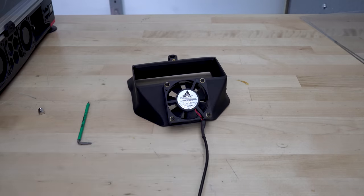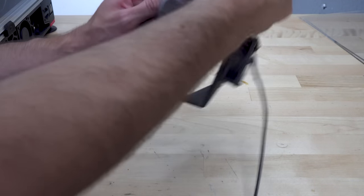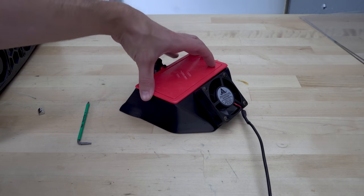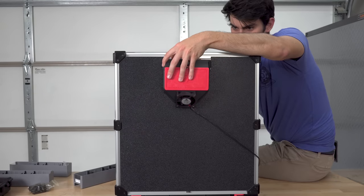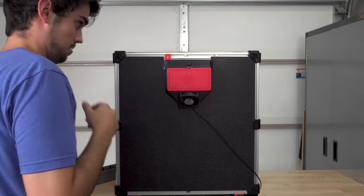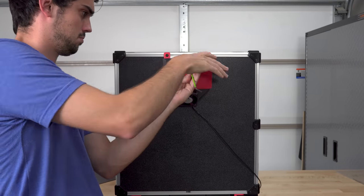While ABS may smell the worst out of all the printable plastics, 3D printing any type of plastic will emit toxic particles and gases. When heated, these thermoplastics produce volatile organic compounds, or VOCs for short, which include benzene, ethylbenzene, and toluene. These noxious fumes can irritate your eyes or make you feel dizzy if you inhale enough of them. Fortunately, activated carbon filters are pretty good at removing these VOCs from the air.